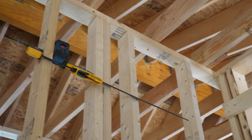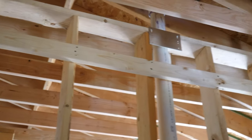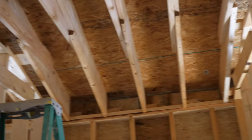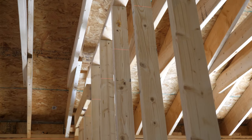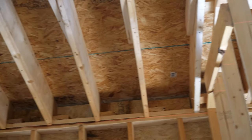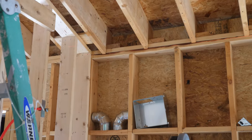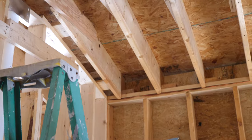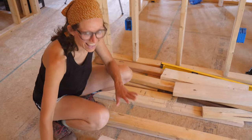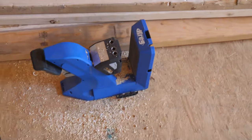The laser is mounted up even with the bottom of the ceiling plane, and we've mounted a ledger up here that will support the joists — pocket-screwed into that on one end, face-screwed and nailed onto the studs on the other side. At the end I switched to a two-by-six ledger and pocket-screwed on both sides of that — mainly to support our bath fan. That's a six-inch-deep housing so it needed more mounting surface than a two-by-four could provide. Shout out to Kreg for making really convenient pocket hole jigs.